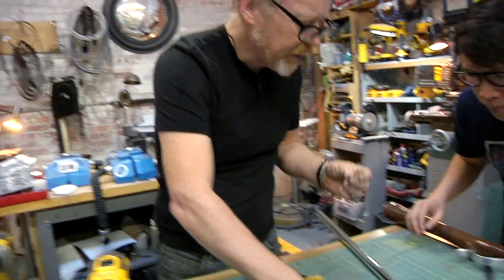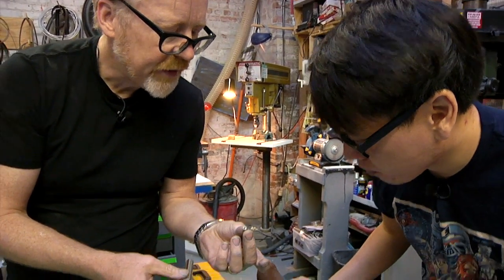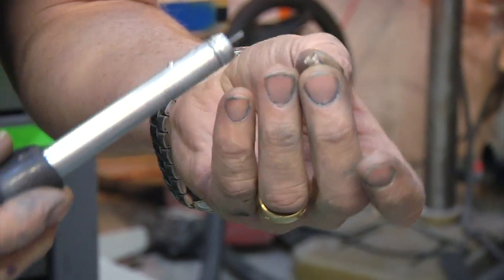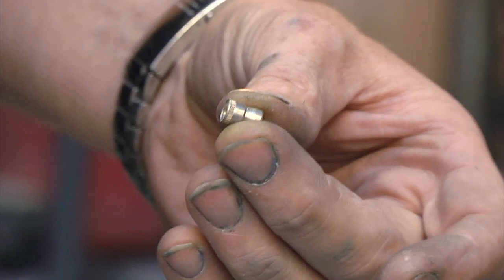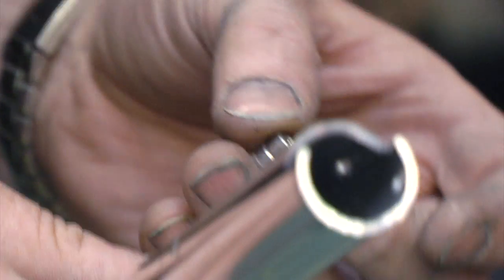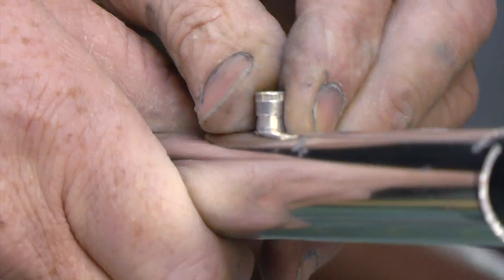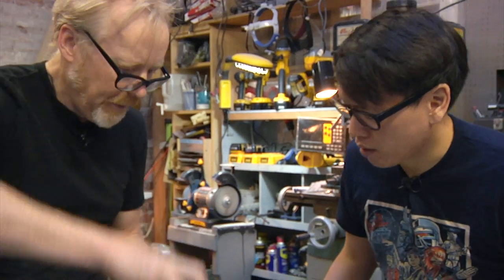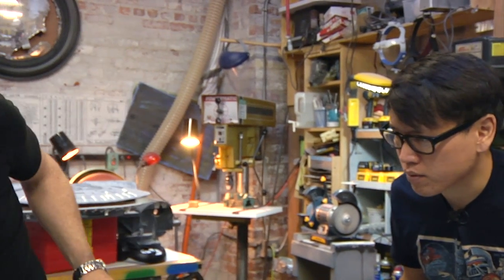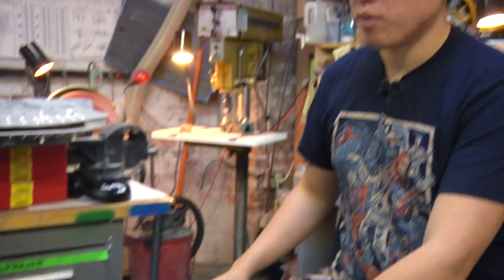Here's how this goes. This threaded insert looks like this. And the way you actually install it is with an install tool that effectively crimps this together and embeds it in a piece of aluminum plate. Because there's no threading on that. There's threading on the inside of this. When I do the install on this, you'll see it crushes the insert, leaving the threading able to be threaded, but embeds it in a plate. It's a really nifty sort of manufacturer's deal, for metal.